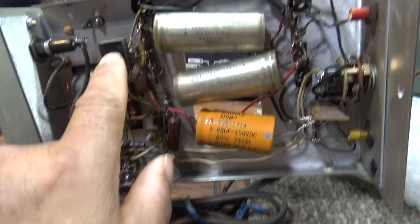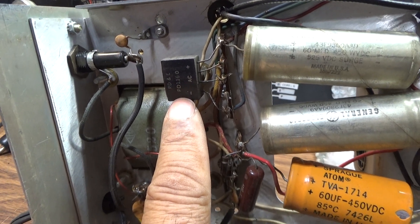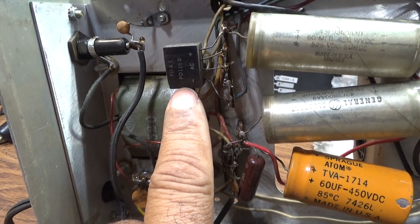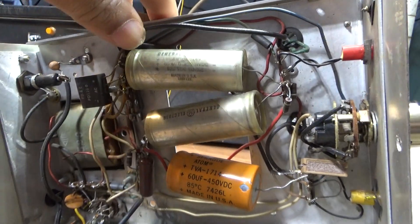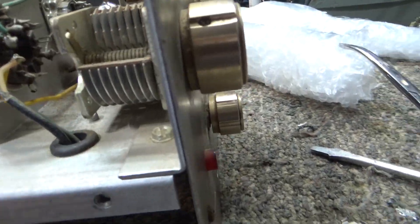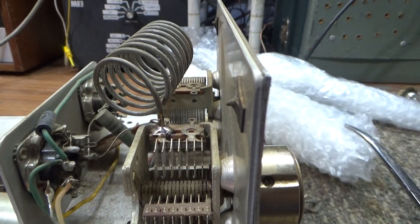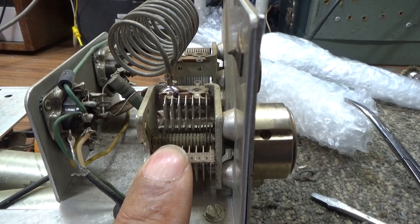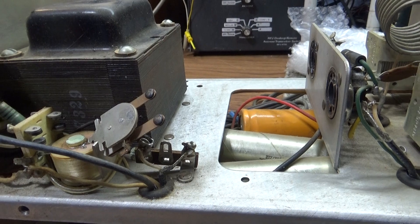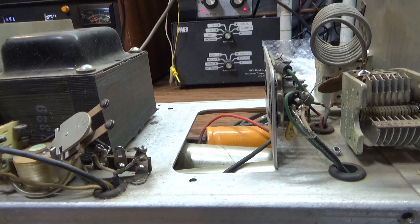So, quickly, the most common things are: dirty relays, bad high-voltage filter caps, sometimes blown high-voltage diodes — usually when they blow you start blowing fuses, and people over-fuse it, then you blow the transformer — and shorted tuning and load caps, usually from overdriving, harmonics coming in, or mistuning the amp. Anyway, that's about all I wanted to go through with this one. Happy hunting out there.